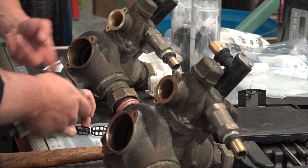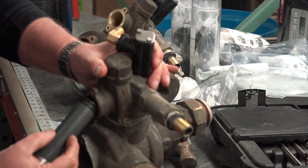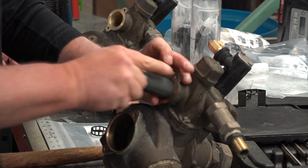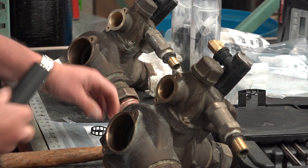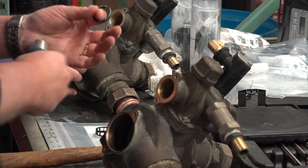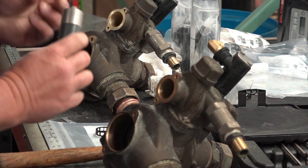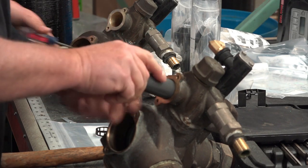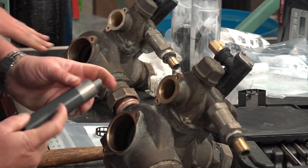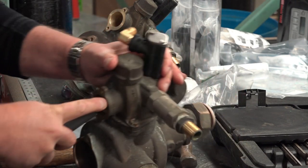Does that make a big deal if some of that falls? I wouldn't think so. But if you drop an O-ring, then you're out of luck. So usually if I rebuild it on top of a valve, I'll just shove a screwdriver in like that, so if an O-ring falls, it hopefully gets stuck in there. If I'm rebuilding the top, a lot of times I'll just shove a piece of paper toweling in there, so if it drops, it falls on the toweling rather than down into the tank.